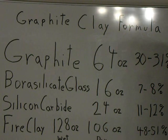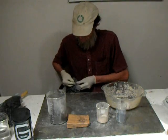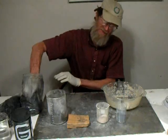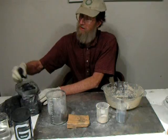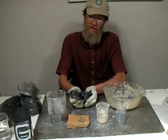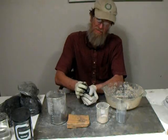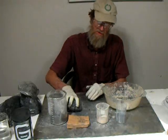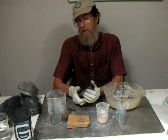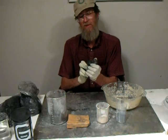We feel like this will work pretty well. The graphite clay looks like this once it has been mixed with all the ingredients. I made this with a homemade clay mixer — it was really difficult to mix by hand. I have left it laid out drying all night to get some of the water out. You have to add a bit more water than you would normally want to use for casting, but it is a pretty evenly mixed, kind of slick mix from the graphite.